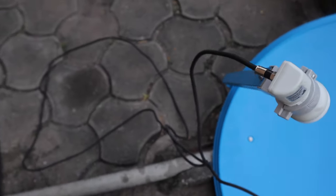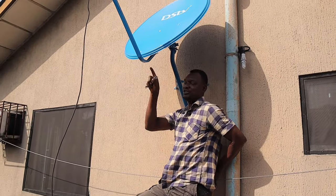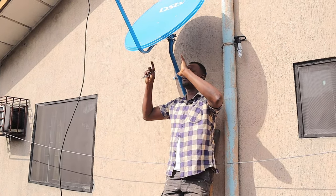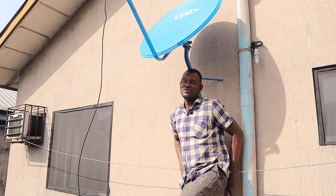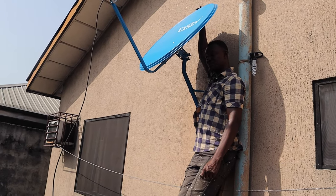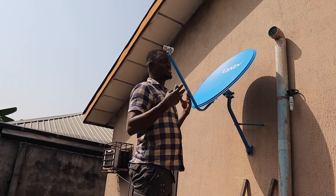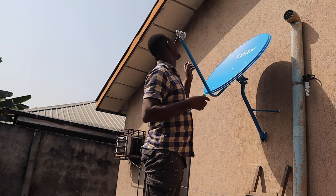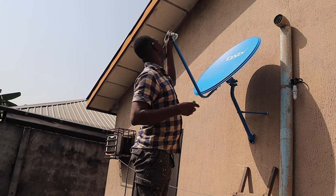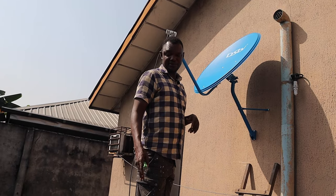You're going to need a short cable, a power source, and a TV or laptop with an HDMI connection so you can see the signal. I'm using a short cable with my modem and laptop. With a little tweak I was able to get a signal. The next step is to get the strongest signal — I found the best azimuth first, then I'm gently adjusting the elevation. For fine tuning you can skew the dish slightly, rotating between about 2:30 and 4 o'clock positions, then check the signal for any improvement.